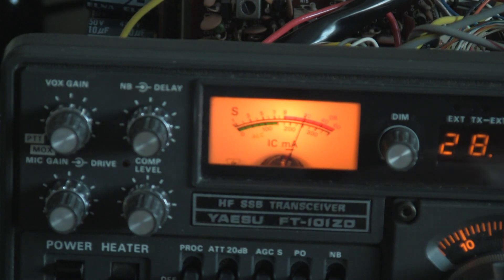Just out of interest, switching in the 10 dB attenuation — it's reading S9 plus 20 at the moment. With 10 dB of attenuation in, it does drop by 10 dB. So the attenuation is good. Putting in 20 dB, it should drop to S9 — and it does drop to S9. So the input attenuation is quite good in both 10 dB and 20 dB steps.